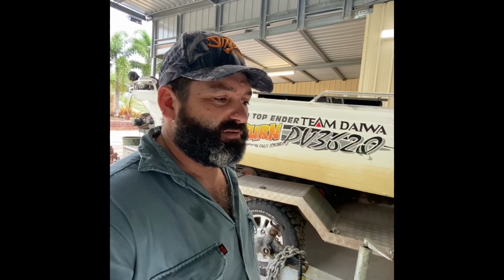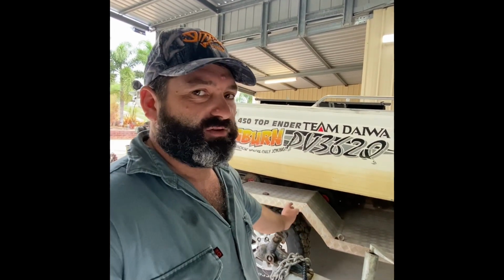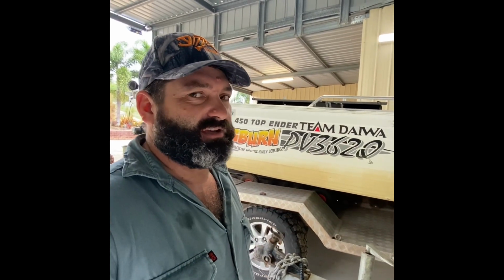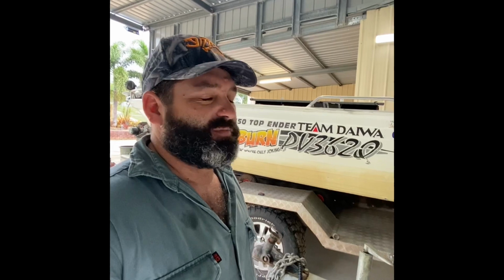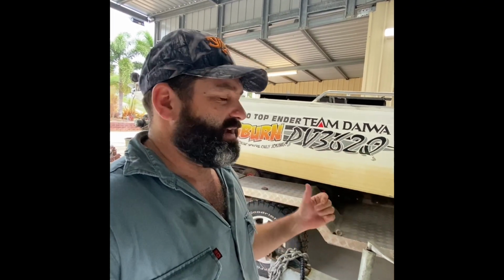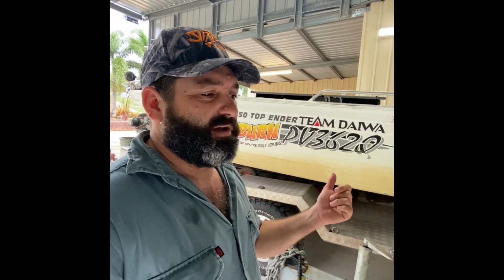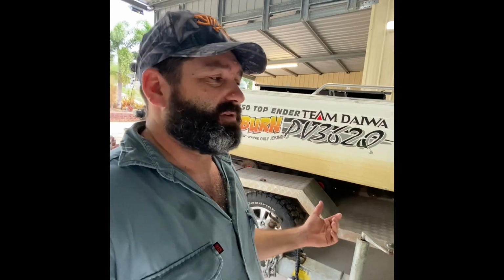And believe it or not, if you build a trailer and use a rear leaf Land Cruiser ute, Nissan ute or anything, a heavy pack with this size boat on it, and you set it up with shackles so they stand up straight, it doesn't carry the weight. I've built heaps of trailers for my friends that won't carry the weight. The reason being is in a car, the car's balanced over 4 wheels and the springs are divided evenly. In this, you put all the load on one end, it just collapses. So you have to run an airbag, or you have to run coils on top of it. So that system also failed in the end, and the rust set in.